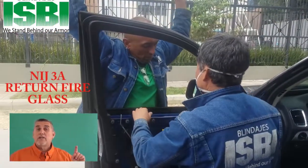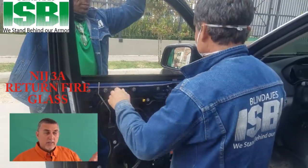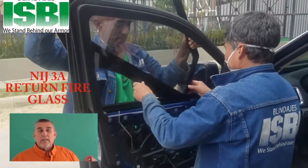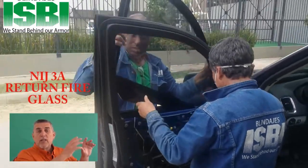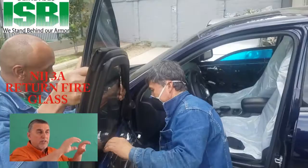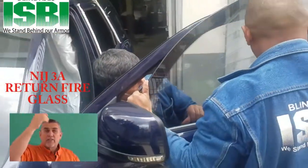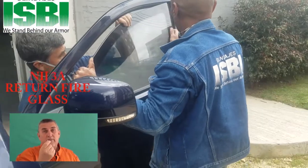Let's take a look at the door first. In the door, you have your glass, and then you have your Kevlar door panels. Sometimes, when you're installing the glass, there are modifications that have to be done to the door. The first thing is the glass is a lot thicker — you're pulling out a very thin glass but putting in a glass that's a lot thicker.